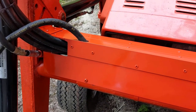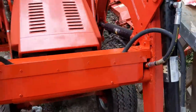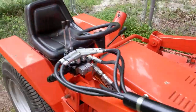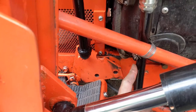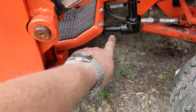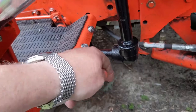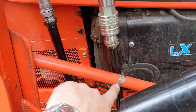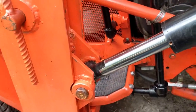Anyway, there it is — final look. While we're at it, a couple more things I dressed up: this is the pressure line coming up from the power beyond port. It was already supported underneath by this U-bolt — so it can't go down and it can't go left and right — but this part relatively could flop around. Now it's tied off onto this support, so it's rock solid.